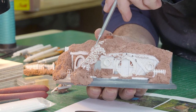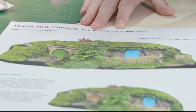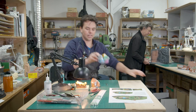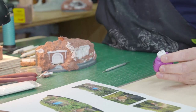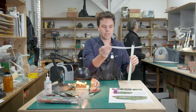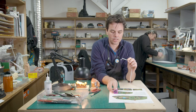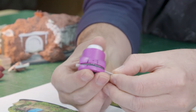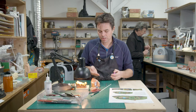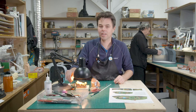On this one I'm putting a whole lot of little leaves on there because in the reference — this is the reference that Dan Falconer has done for us — there's a whole lot of leaves and that coming down there. For those we've got some handy little stamps. You just take a bit of your handy strip styrene — a nice thin piece, about 0.25 millimetre thick — and you jab it in there. Lo and behold, we've got some little leaves. And that's a lovely relaxing thing to do on a nice wintry morning.